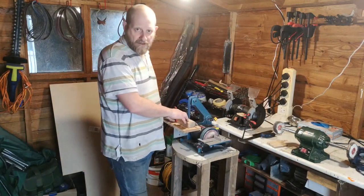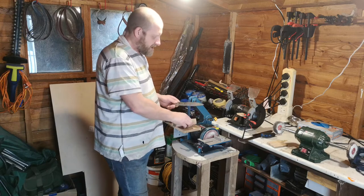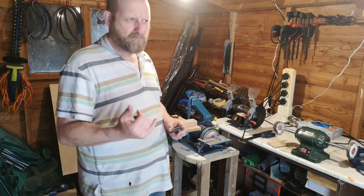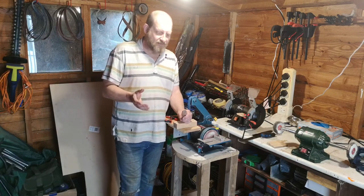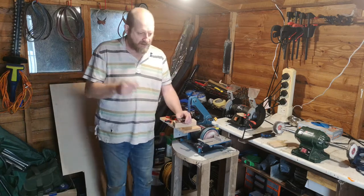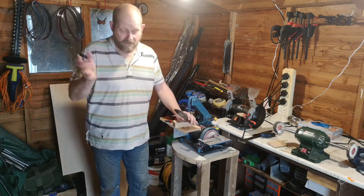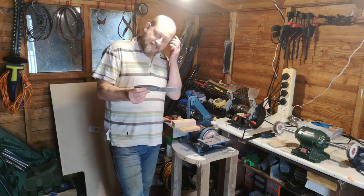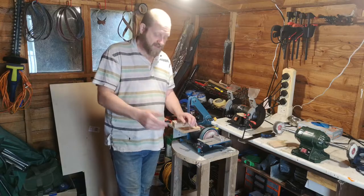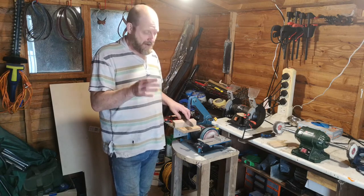Right, let's heat treat this one. This is still 1080. With 1080 it's a little different when it comes to heat treating. The early blades I used were 1070, which has a much simpler heat treat — you heat it to around 830–840°C, non-magnetic, then quench in canola oil, which for UK guys is just rapeseed oil. With 1080 you need to soak the steel — that means keeping it at a set temperature for a certain amount of time. I've come up with a system using my forge to monitor temperature and keep it within about 10 degrees.